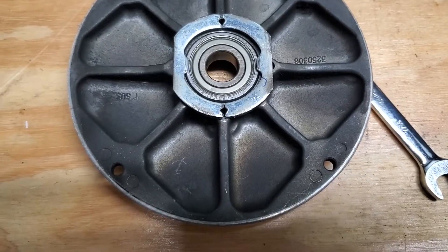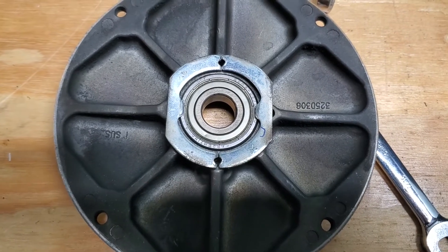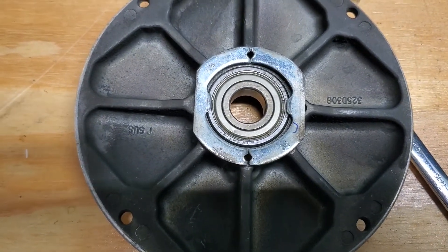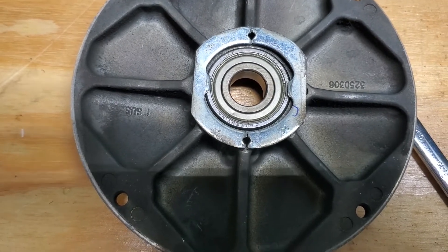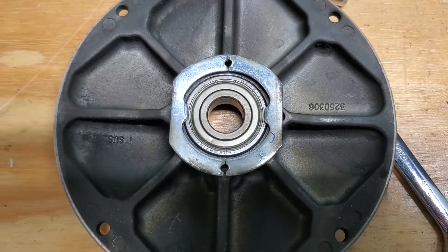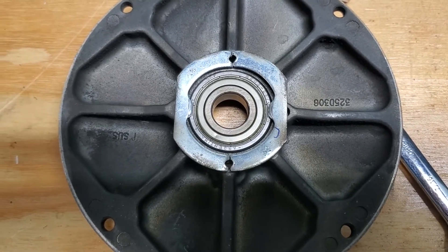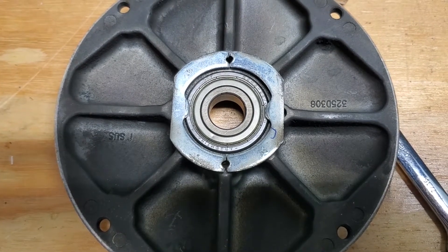You can see the little fingers that come and touch the bearing — that's just to touch the outside bearing, not to touch the seal anywhere. I think the biggest reason for that is you get so much carbon particles coming off the brushes as they wear down that you could get something in there and start to break the seal open and cause the bearing to go out early.